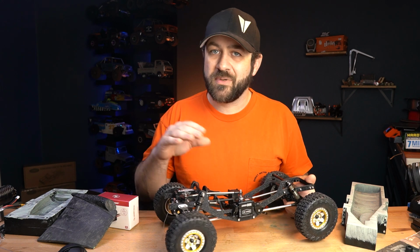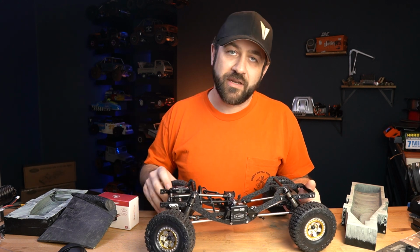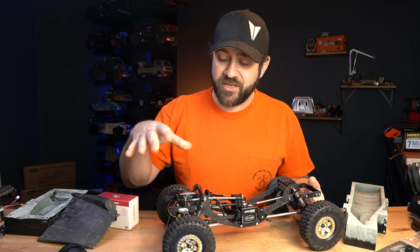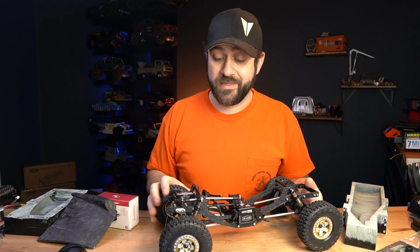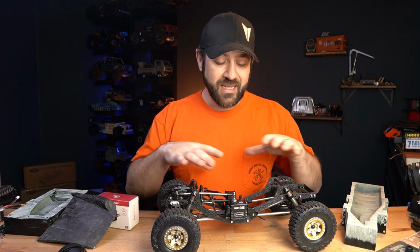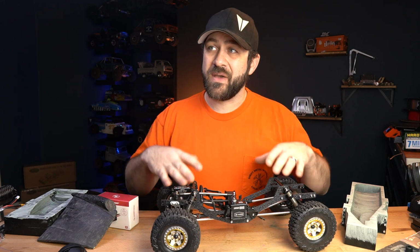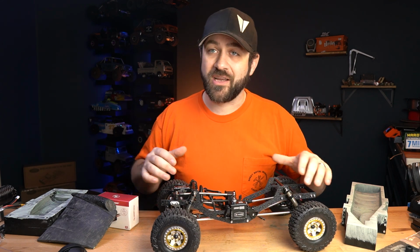The front geometry is always the hardest for that. Upper link clearance, drag link, tie rod, steering, flex in all directions, and making sure that it clears all of the components. But luckily, we've got that nailed. This is looking really good, so I don't have to focus on this as much right now. I can just kind of use it as my base, modify as I need before I go to the final version.